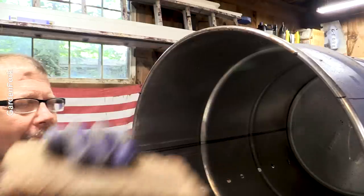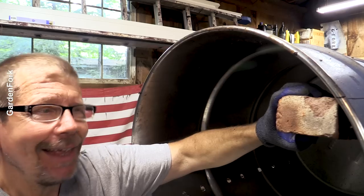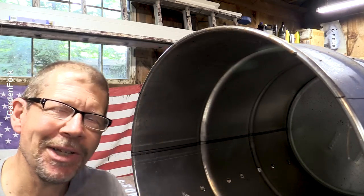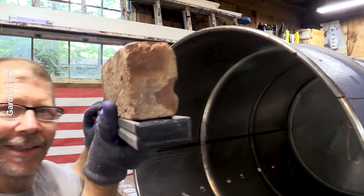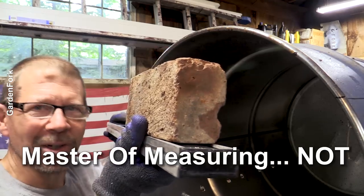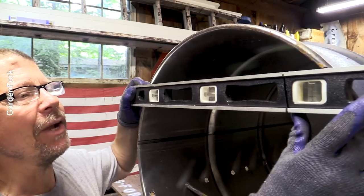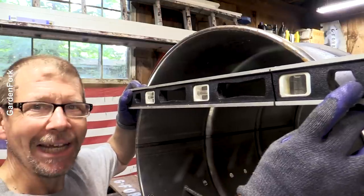Still kind of marked. So this has to be basically like that. And bricks are two and a quarter inches high. And you know what also is two and a quarter inches high? My level. So I am not a master at measuring, but I know if this is two and a quarter and that's two and a quarter — I'm going to line up my old marks, two and a quarter inches below, and make new marks.